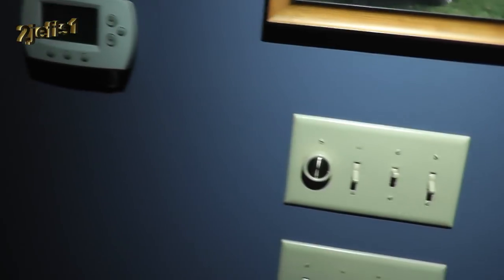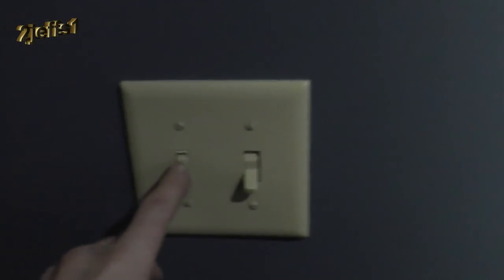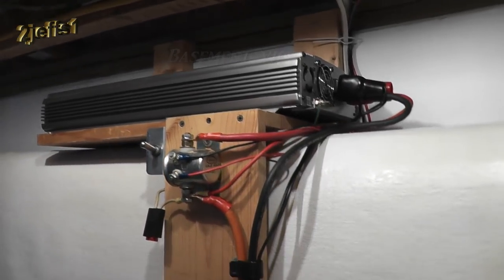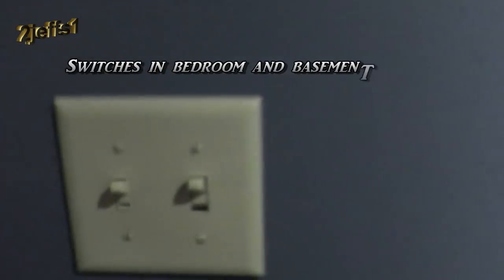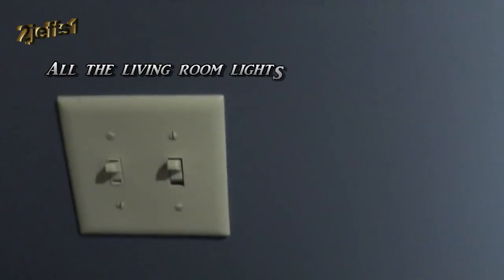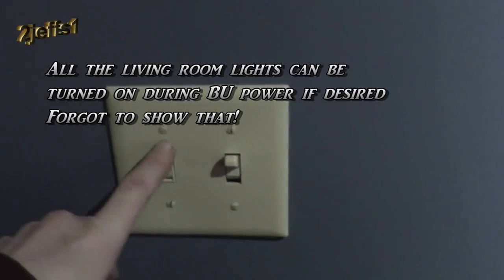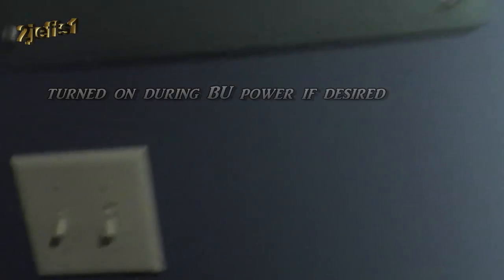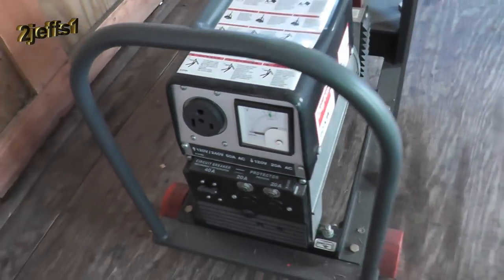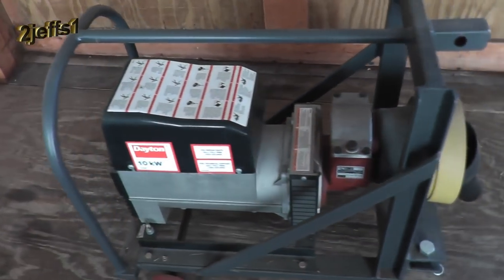Now I've got to show you this one too. Let's continue on. We have some more switches here. Throw that one — oh crap, the lights went off. Okay, you throw the next switch. Oh, the lights come back on. We're running off — there's one of the indicators up there. Anyway, yeah — we're running off 12 volts right now, and that'll power the living room. There's a light in each hallway, the bedrooms — that all comes on like a little 3-watt light when you throw that on. And we can go back to your line voltage. There. Now we're back on your line voltage. And if you run out of juice on the backup batteries and 12 volts, you can always go get the PTO generator with the Kubota.